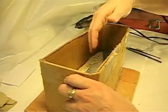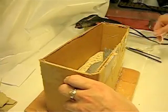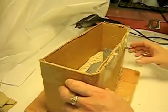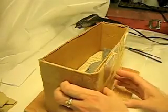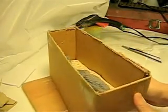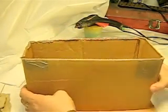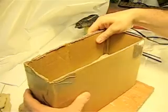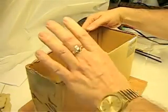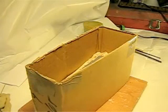We have our little spider webs from the pouring the glue. Just pull those right off so they don't get onto the sculpture. And what we're going to do is work our way around and start turning this around so we can get the other sides. I'm just using a standard piece of wood. You can notice that it has some wear on it. This has been used several times for molding, and I just reuse them again. There's no reason to keep using new pieces of wood. It's not necessary.